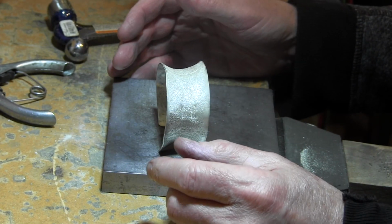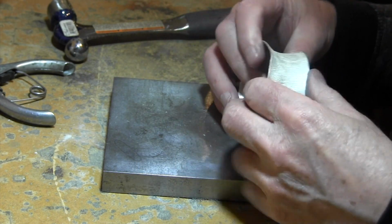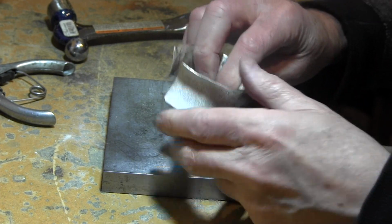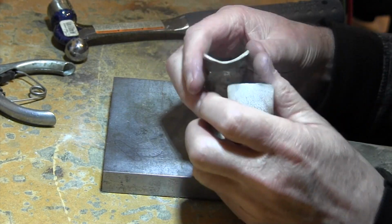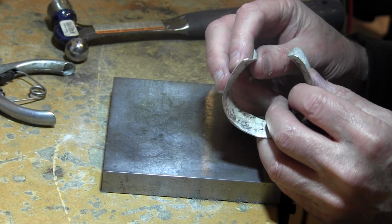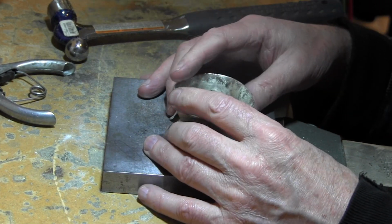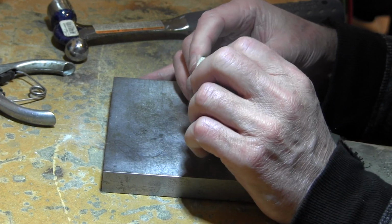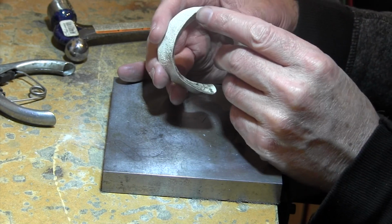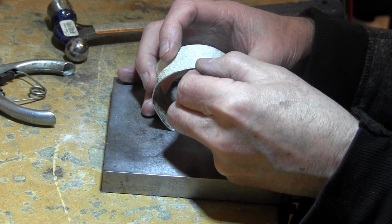One thing about an anticlastic shape is that you can twist it, but it's very hard to bend it. Either way, I mean, this is stronger than heck, but you can actually twist the anticlastic shape like that. And that allows you to get at points on the ends and in the inside. So I'm just gonna fix up a few little things here. I don't like this, it's just too exaggerated. That needs to be taken care of on the stake.